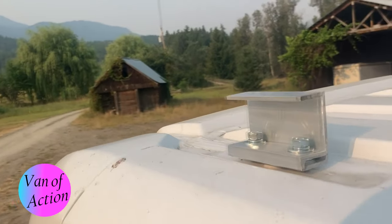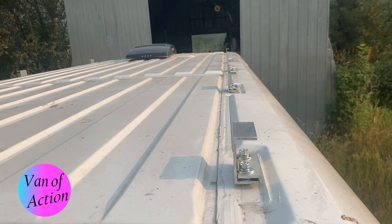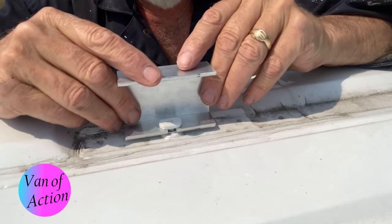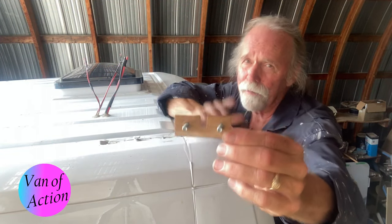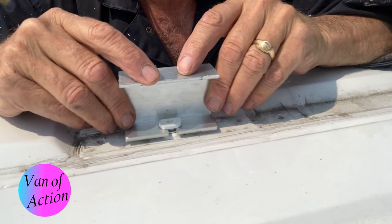My clip design is wrapped completely around those pins. I don't rely on the roof panel itself to hold anything up — it's completely wrapped around the pins. I took a two inch by one inch by one-eighth inch aluminum C-channel and fit it around each pin as a clip, with the hole for the pin in the center and a little bit on each side. I made mine three inches long. As for the hole diameter — truthfully I don't know. I started with a piece of wood as a prototype and just kept machining it until it fit snugly around the pin. One-eighth inch stock is as thick as you can go, because below the pin there's a detail that gets a little bit thicker. So keep it to one-eighth and you should be fine.